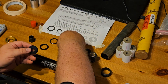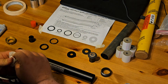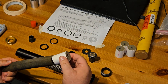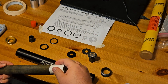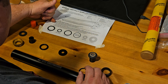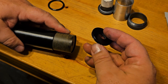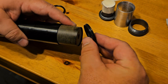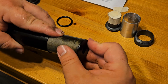Now I'm going to take the seal disc and put the seal disc O-ring on there — there's a groove, and it just slips right onto it. We're going to take the liner; there are five 38-millimeter grains, and we'll insert that into the rocket and install the seal disc into one end. Pro tip: the forward seal disc has a forward and aft side — the top side is a little bit wider than the bottom side, so it will fit snugly into the grain liner. If you put it the other way, it doesn't seat itself. Make sure the forward seal disc gets seated in there correctly.